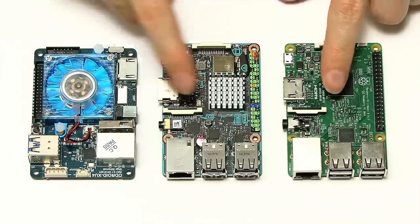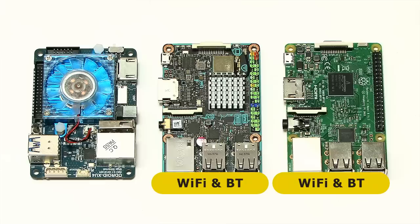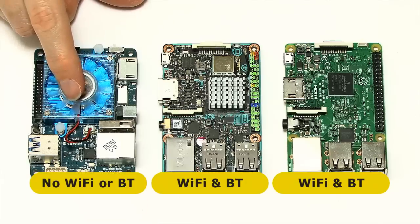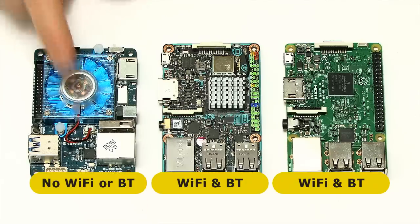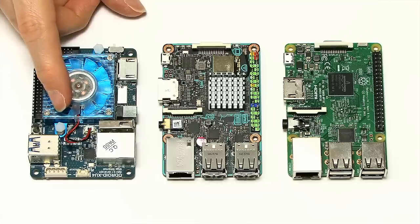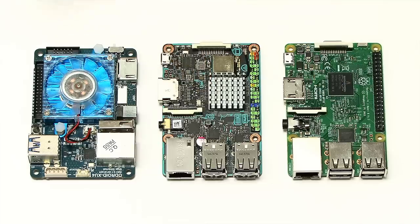You may well want wireless connectivity. On the Raspberry Pi 3 and the TinkerBoard you've got onboard Wi-Fi and onboard Bluetooth, whereas on the Odroid you haven't got any onboard wireless connectivity. So if you want to connect by Wi-Fi, for example, you'll have to add a dongle, and that will take up a USB port. So you get down to two available USB ports on the Odroid using Wi-Fi, while you have four on the Raspberry Pi 3 and the TinkerBoard.